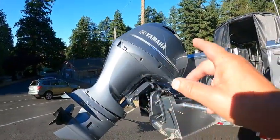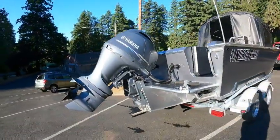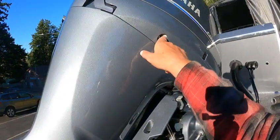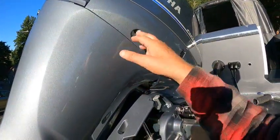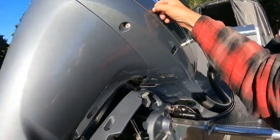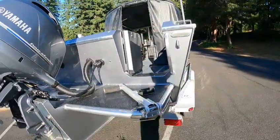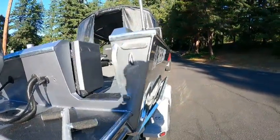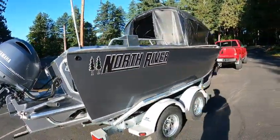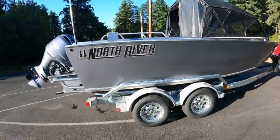Don't be alarmed if the kicker's going to pee out a lot quicker than the main — this one will take about 15 to 20 seconds. If the pee hole does get plugged, carry a paper clip with you, unbend it, and poke it in the hole. Sometimes it gets plugged with sand or pickup debris. If that doesn't work, get in here and pull that hose off — if no water comes out after reaming that hose, you've probably got an issue. A buzzer would go off and RPM reduction would kick in at 2200, so at full throttle you wouldn't go anywhere.